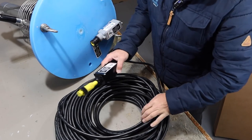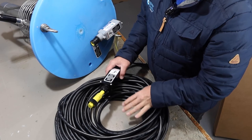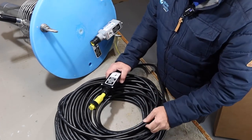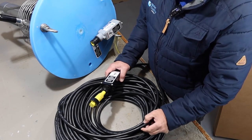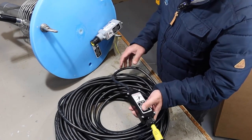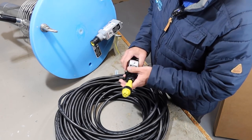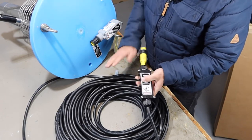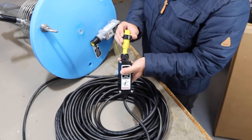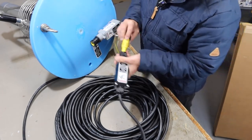On the cable — this is what's called the drop cable — it runs out from the motor unit in the middle of the dam and comes back to the control box on the shore. The cable used is a submersible rated cable; it drops down to the bottom of the dam, runs along the bottom, and then up the shore to the control box. This is the female connector for the electrical quick disconnect. The female connection runs on your drop cable and the male connection is on the piece of equipment, with a notch that ensures it will only connect one way.